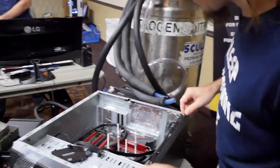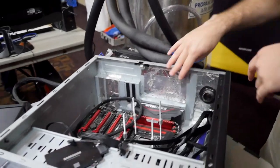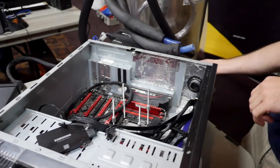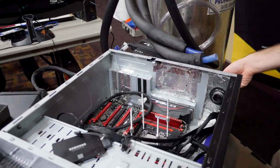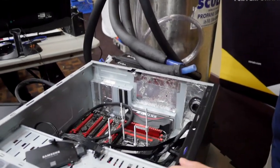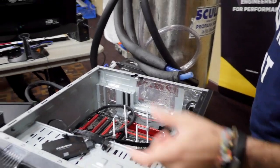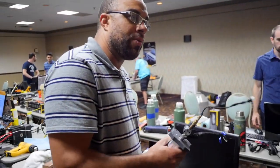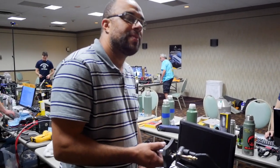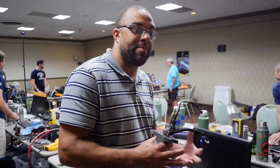Very ugly. So you can see he closed down the hose here to make it as airtight as possible. There's some pipe here to... also inject some? No, to remove the LN2 vapors. What we do is take the exhaust from the containers, the pots, and reroute that exhaust back to the case. What that does is purge out all of the ambient atmosphere.